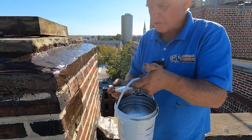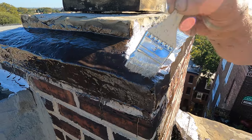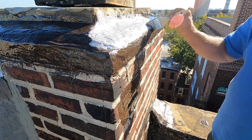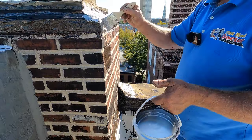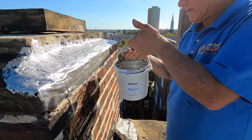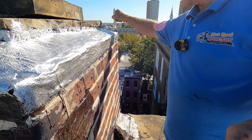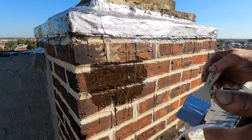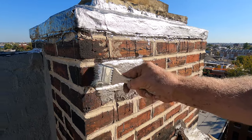That's what you have to do. You can paint it any color, but the silver coat protection is the best. It's aluminum asphalt paint, and you paint this over the transition like that. And look at it — beautiful. This will never go bad. You'll never have that concrete crack again on this chimney. The chimney cap and crown is now complete with the final step of adding silver coat protection over the turbo poly seal. That way, you'll never have to do it again. It protects from the ultraviolet.